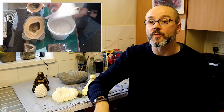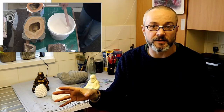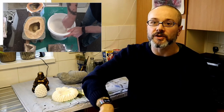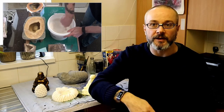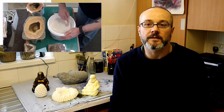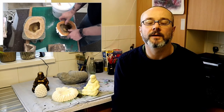When you're stirring, be mindful not to introduce any more air. Let the plaster settle into the water before you stir, then stir quite carefully but deliberately to get the plaster nicely mixed in with the water. Get that to a nice, consistent mix and then you can pour it into your mold.